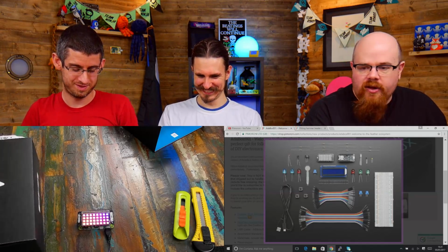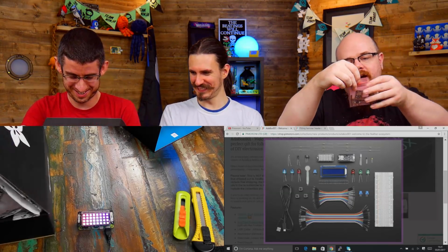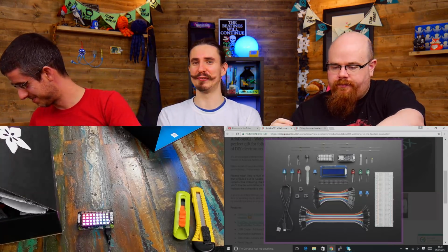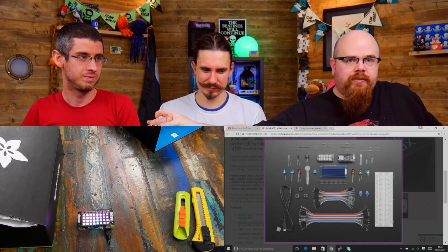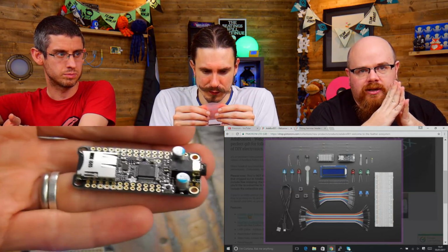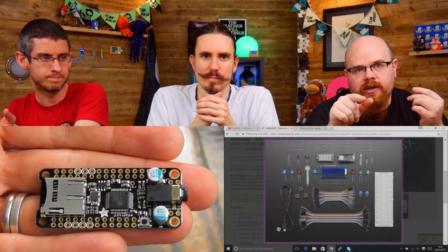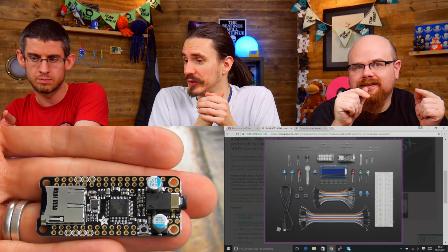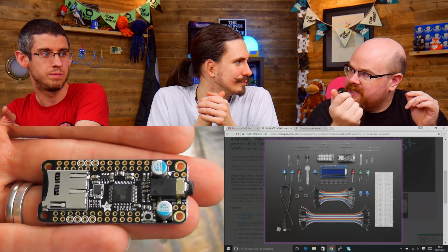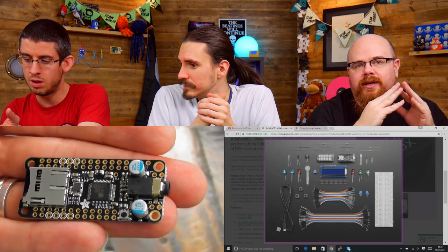Right, so that's one new thing. The other thing we have is the Adafruit Music Maker FeatherWing. This is the MP3 music maker that has been an Arduino shield, now specifically formatted for Feather. It's got an SD card slot, which the chip uses to play sounds on command. It's also got a MIDI mode, so you can take MIDI data over the UART to trigger stuff, which is pretty cool. So if you've got a microcontroller, it's a good way of doing sound.